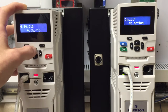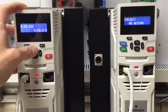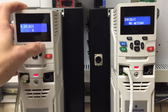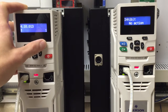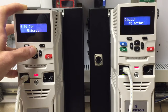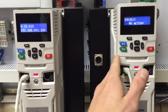We will make this 1. Then we will enter in the parameter that we will be transferring — in our case 3.29 — at parameter 10.13. This is the parameter count; we will only be sending one parameter starting at 3.29. Ensure that 10.14 is on unicast and that 10.15 is the IP address of the receiving drive.